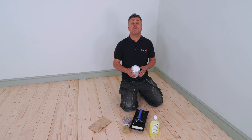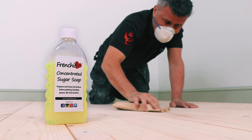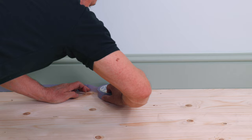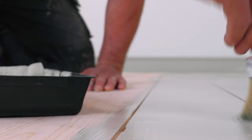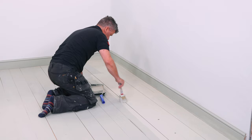I'm going to show you how to paint wooden floorboards with French Chic's Alfresco range. Preparation is key — give it a light sand first, clean it with sugar soap if required, then hoover up all the dust and debris. Then mask up around the skirting boards if you're painting the floor a different colour. Give your paint a good stir and dilute it down if you're applying it onto bare wood — I've diluted it just 5%. Apply it with a small four-inch radiator roller to cover an area and then feather it off with French Chic's oval brushes for a nice smooth finish. Give it a light sanding once it's dry before you start your second coat — roll the paint on with your four-inch roller, feather it through with your brush, leaving four hours drying time between coats.